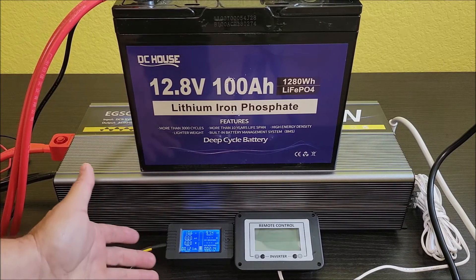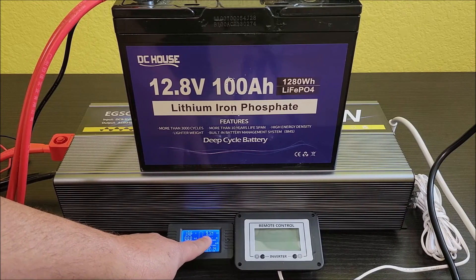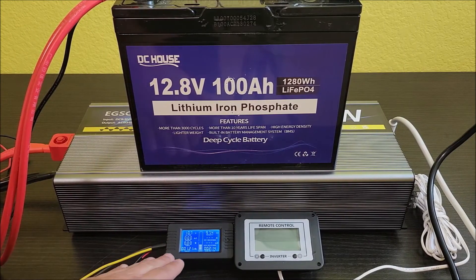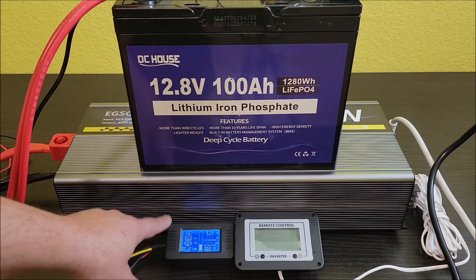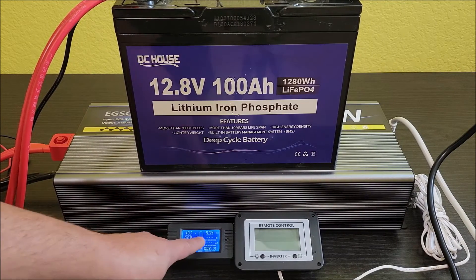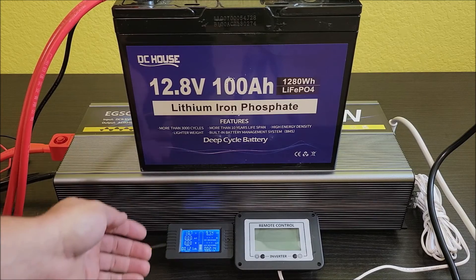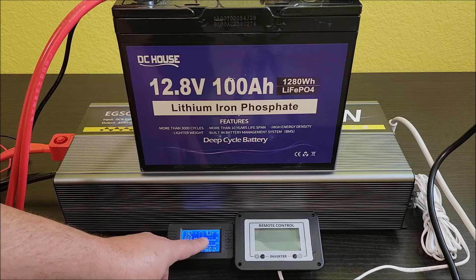In general, this is what I'd consider the battery's maximum capacity, and we hit 97.4 amp hours. There will be some fluctuation in charging — I could charge these up and maybe get 100 amp hours. It also comes down to the load: if I was doing this test at only about 10 amps I'd get a better amp hour rating because I pulled it out slower. The bigger the load, the more it affects your amp hours.